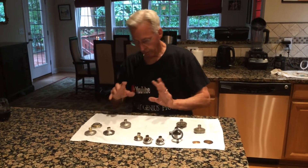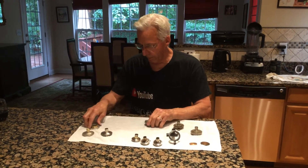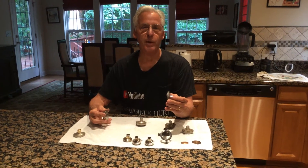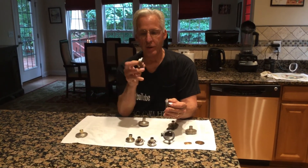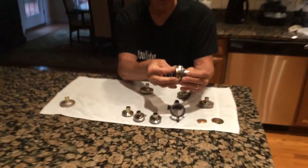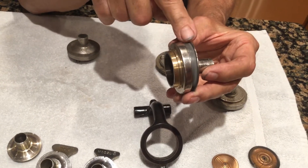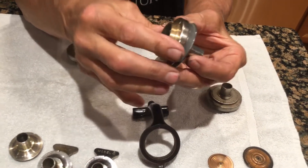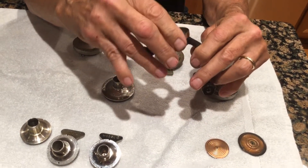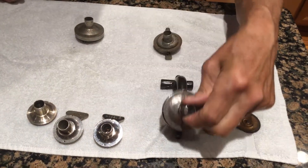The other little nuance of these things is that this is pot metal, and it swells up like you've been on a cruise ship. I've discussed that before. And this piece is brass, and they put those two together. And what happens is the pot metal swells up into the brass ring. This is the spacer part that fits in there like that, and then you have your Reproducer.